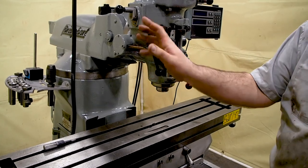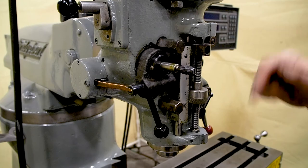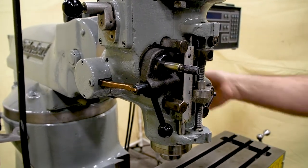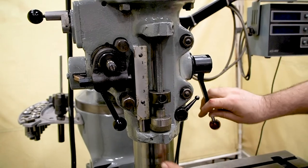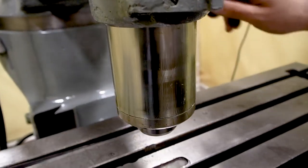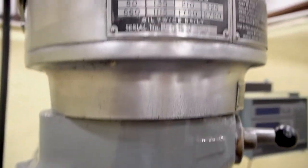All the feed linkage came off here — everything got cleaned. New dog bone was installed. It will knock off on down stroke and up stroke. The pull clip came out, everything was clean. Clock spring was adjusted properly. Everything is in nice shape on this unit.